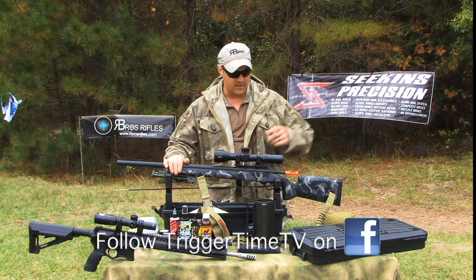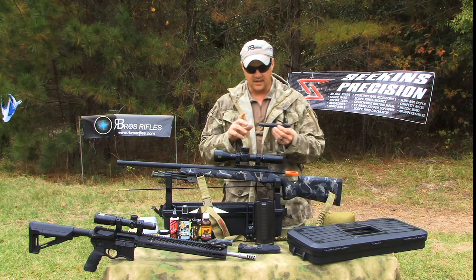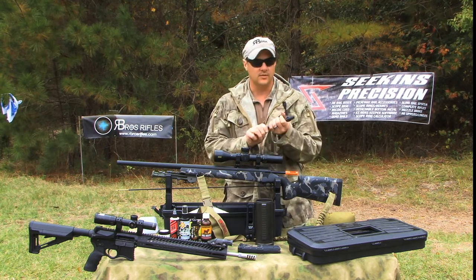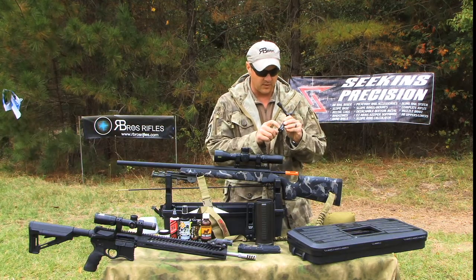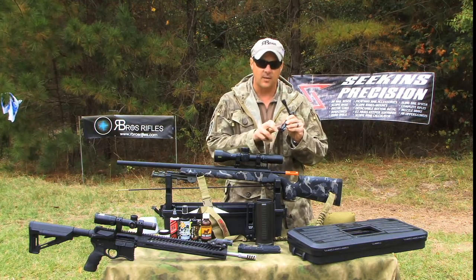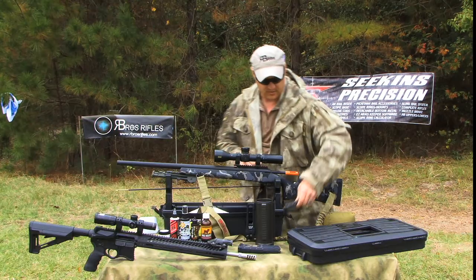This is going to sit for about two to five minutes. While I'm doing that, I'm going to come back to my bolt. I'm just going to take a dry cloth and wipe that off. I'm going to take a little toothbrush and scrub it in there. I'll take special attention to this little AR-type extractor, and just make sure I get all the brass out of that so I'll have a good controlled ejection.